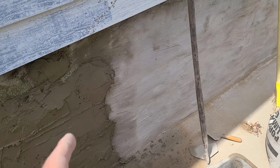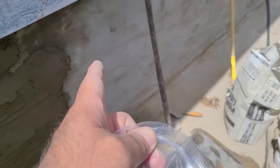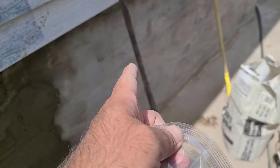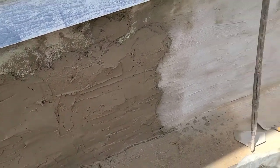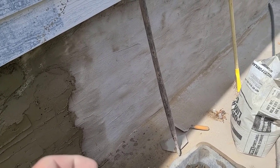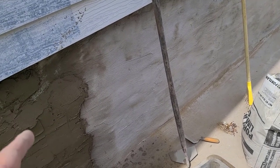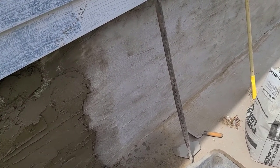What I'll do is go along and paint a little bit of portland paint on those cracks, then patch over the top of the shrinkage cracks - that should cover them up and they shouldn't come back. This is not holding up the house - it's just protecting the limestone foundation - so it doesn't have to be perfect. If there are some cracks it's not going to hurt anything. The reason I cover it up is so no moisture gets in behind there and causes it to peel off faster. We'll probably paint this in three months so it matches the rest.